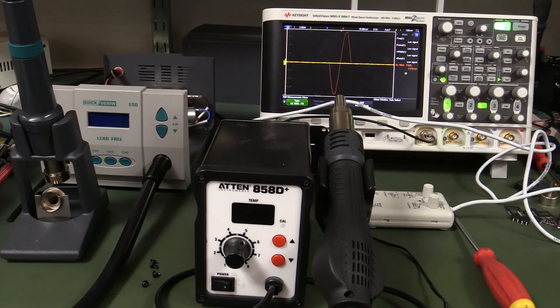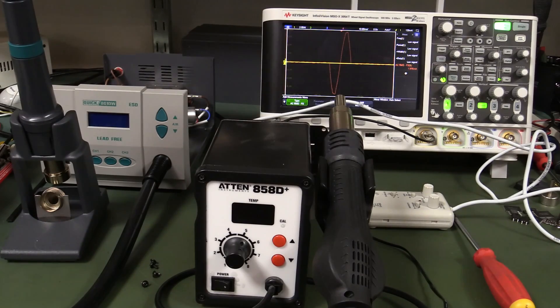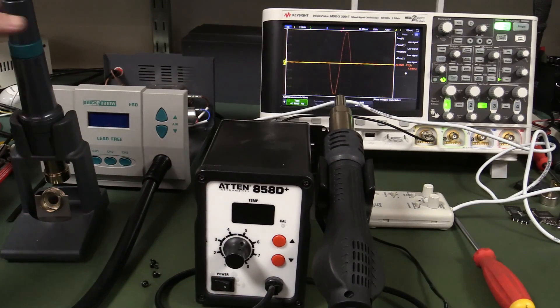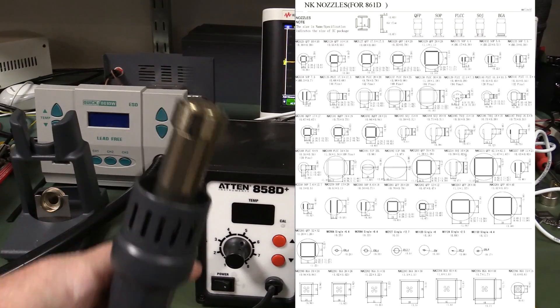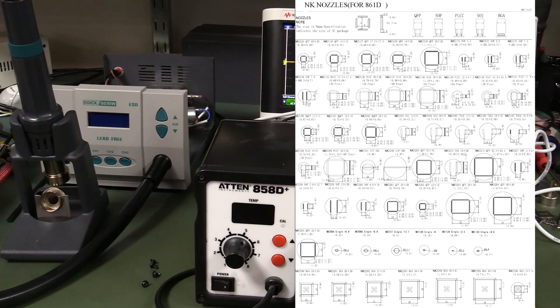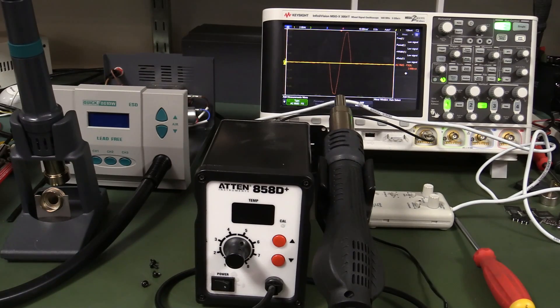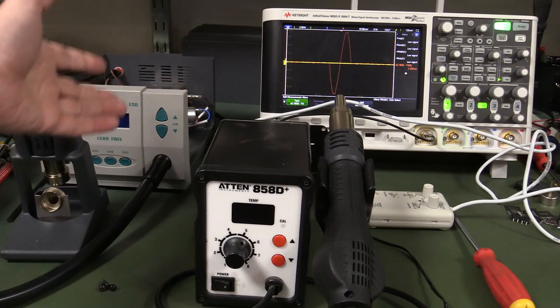The Quick actually meets or slightly exceeds its 1000 watt rating — a genuine spec. The Quick is just a much better unit. The ATEN does the job, but as I said in the previous video, the $200-$250 price difference matters: if you spend longer on a board with the weaker tool and damage it, you could easily lose $500 worth of work. I also found the actual tip catalogue for the Quick — it has a huge range including BGA and quad flat pack nozzles. The ATEN is more of a toy by comparison, though you can get some third-party attachments since it's sold under dozens of brands.